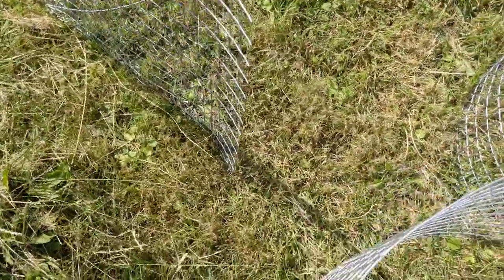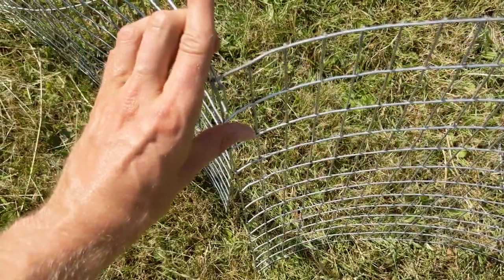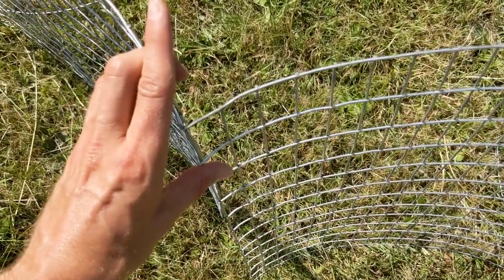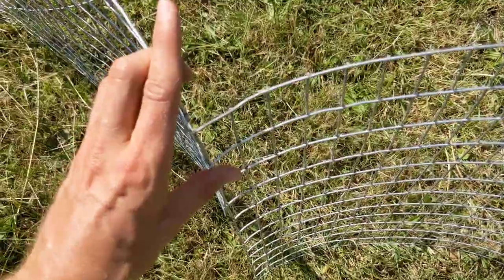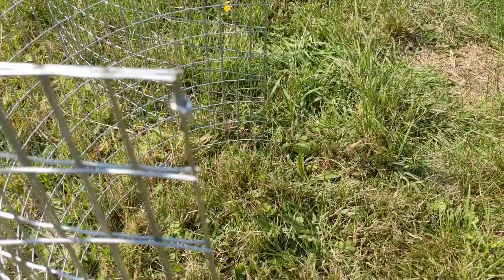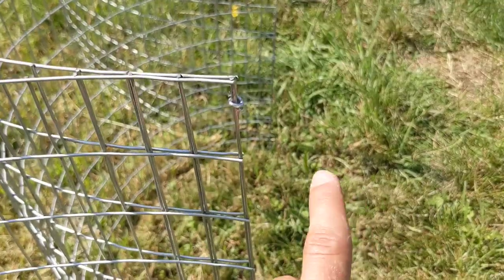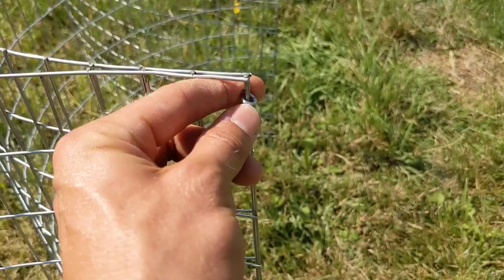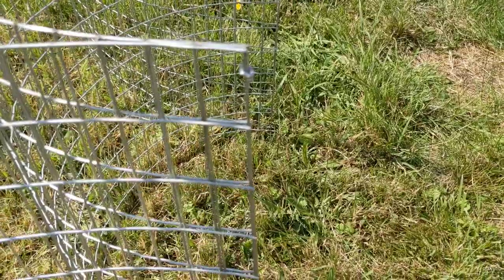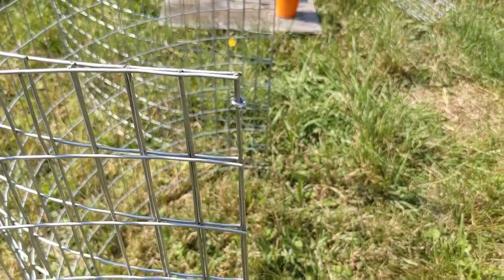And that is going to require me to crimp together these two as well as one that goes down the middle. So that's going to be three crimps. If you accidentally start crimping wires, it's easy to just start working on different parts. But if you accidentally start crimping things together and then realize you have to add another wire on top, it kind of sucks to have an existing crimp like we have here and have to add another wire on top of that, because this will get in between that third wire and you just don't want that. You want to be sure you're crimping all the wires that you're going to be crimping around at the same time, because otherwise you're going to do work that you're going to have to undo. So that kind of sucks.